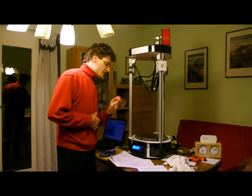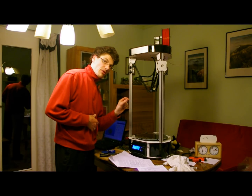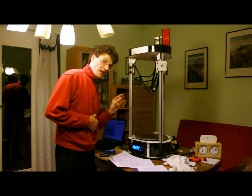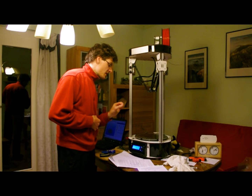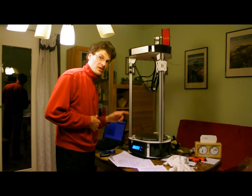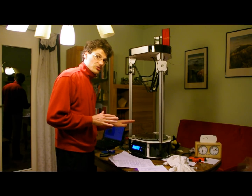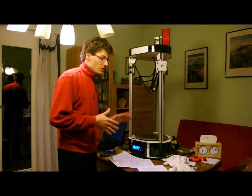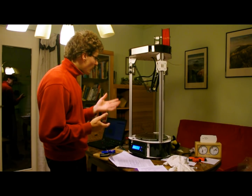It appeared that a little wire directly from the thermistor broke. So I soldered it again very carefully, and there was again a little crack. Then I soldered it at a lower temperature — normally I solder at 350 degrees, then I went down a little bit below 300 — and now it works. I don't touch it anymore and I hope it holds. I don't know what I did wrong. So this was really a problem, it took me some time, and now I'm calibrating.